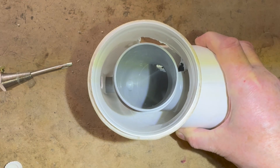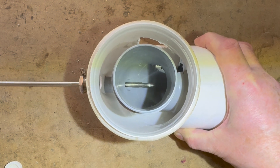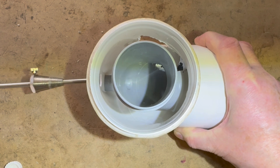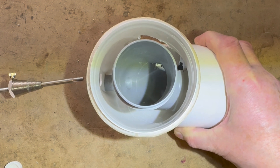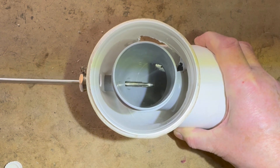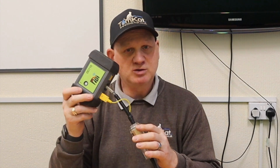The correct location for analyzing with your probe is in the center of the flue ways. For this ideal boiler, you literally only need that much of the probe to get into the correct position. There is a little filter in here which should stop that very acidic water.